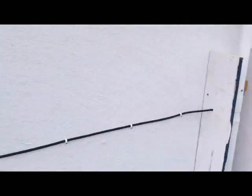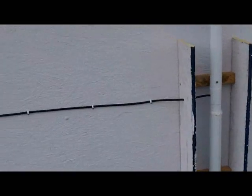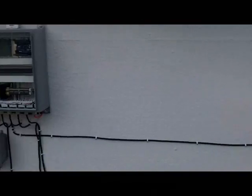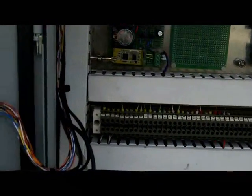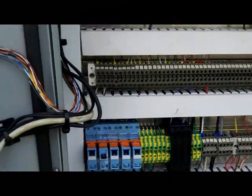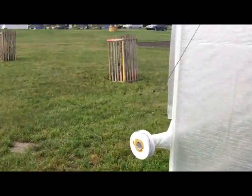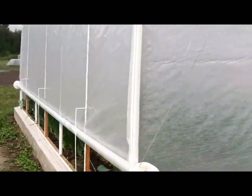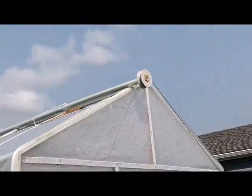The way this one works is pretty much the same: there's a temperature sensor on the outside and a temperature sensor on the inside, and it basically just compares the two and moves the louver accordingly. I'm going to show you the action — right now it's regulating at about 20 degrees, but I'll just manually open it so you can see the louvers open all the way up.